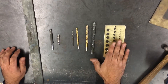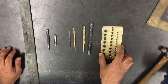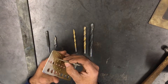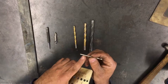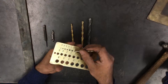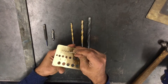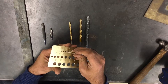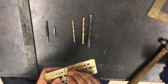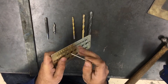I've also got a drill gauge set up here. If you are trying to select proper drill bits, you can use a drill gauge to see what size the bits are, because often when you try to read the drill bit the markings have been worn off. To use a drill gauge, you simply place your drill bits into the holes until it meets a hole that it can't go into. So if it fits into this one but not this one, that's where we're at — this one says 9/64ths. It does not fit into the 1/8th hole.